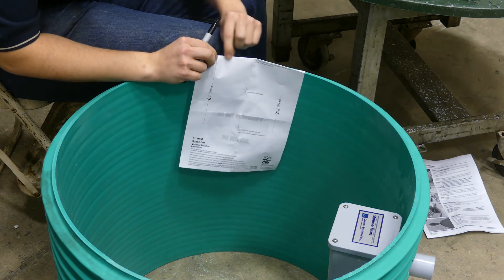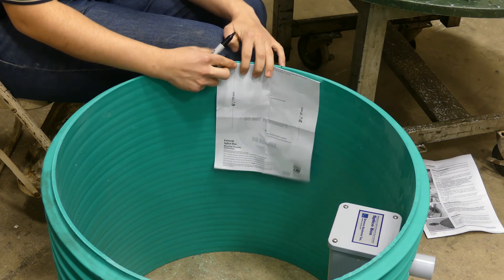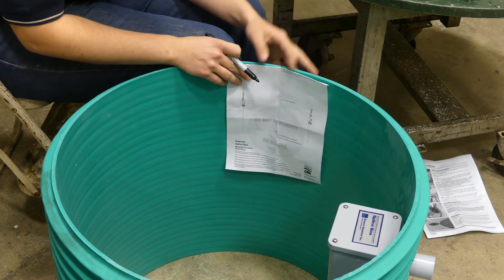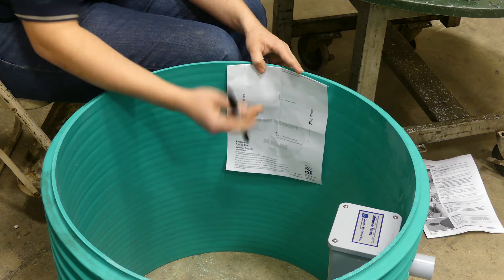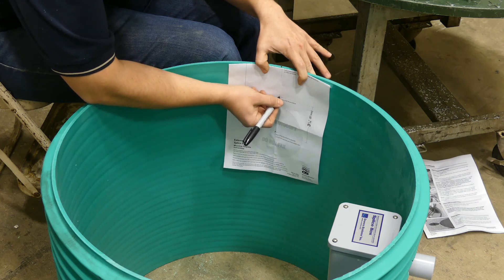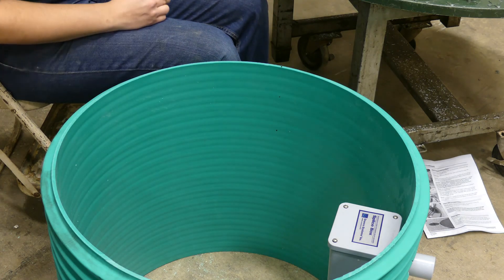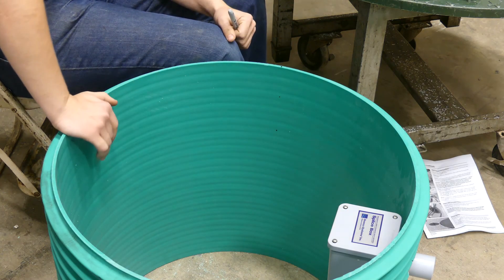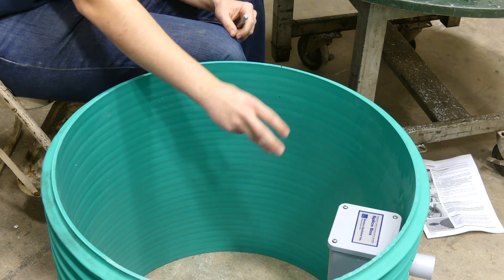With our guide, the top of the dotted line indicates that you want to line this up with the top of the riser. The goal with these external splice boxes is to have the top of the splice box flush with the top of the tank riser so that it's just as easily accessible. That's actually one of the main pros of having these external splice boxes — you don't have to open the tank itself to gain access to the electrical wiring to do tests and so forth. We've also got an internal splice box installed in this riser, which is being used for demonstration; we just did a video on that, so check it out if you're curious.